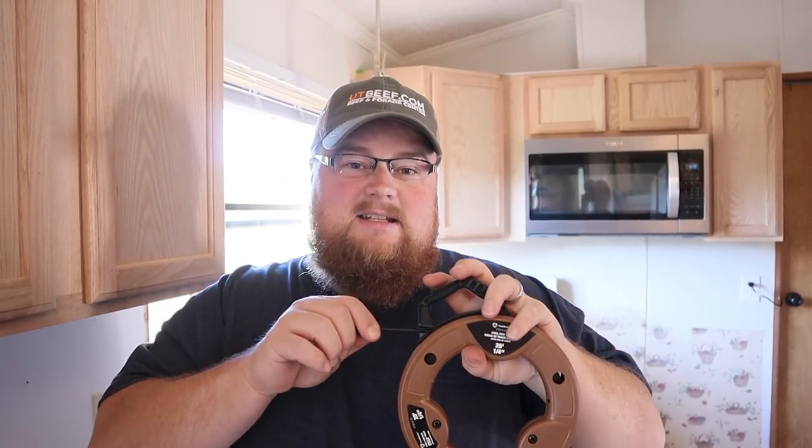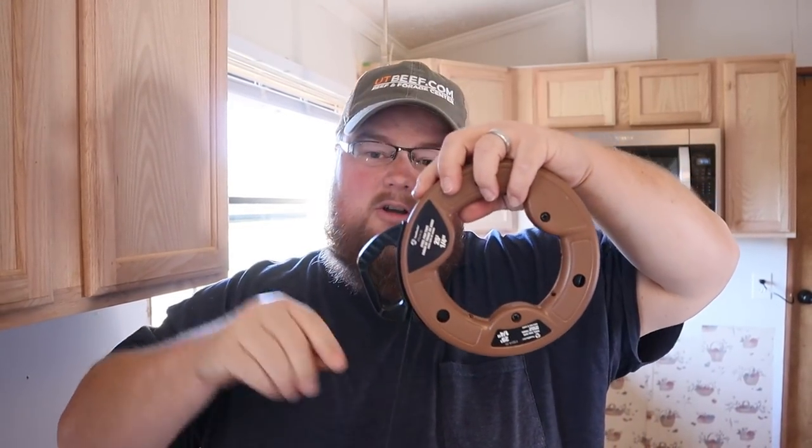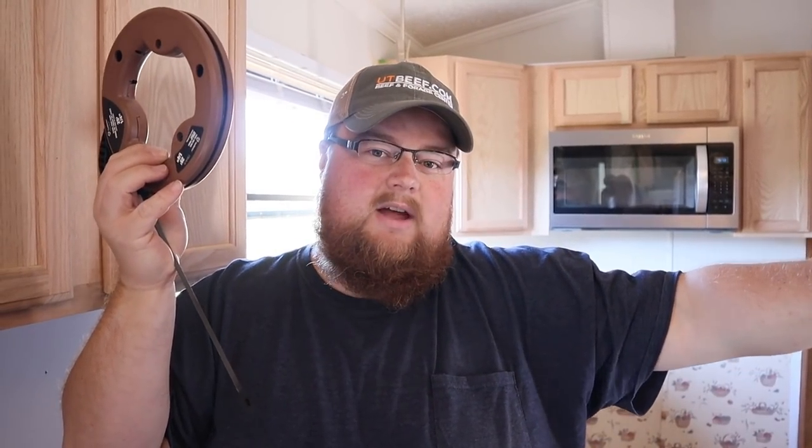So here's a look at the fish tape. It's not too big, but this is only a 25 foot long one. Basically, it's a roll of steel that's 1/4 inch thick and flexible. And it's got a little rubber tip on the end that you hook wires to. What I'm going to do is fish this down the hole in the floor, or in the wall, and let it kind of curl back and go that way. And we'll fish stuff out, or fish it through, or do something fishy.